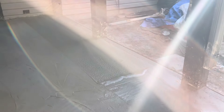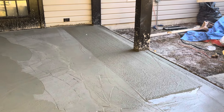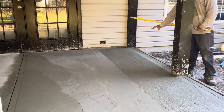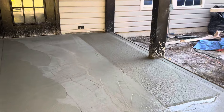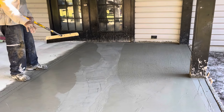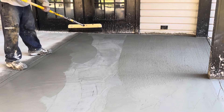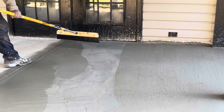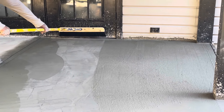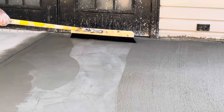See, it's kind of wet there — that means it's digging. I'm going to wait and let that dry a little bit more, because you can literally see the difference: this part is more dry, that part is more wet. This is getting really dry so I need to jump on this now. You can literally see the color changing — see how it's smooth now. Just get a nice broom edge, you don't gotta put no pressure, just let the broom do the work.